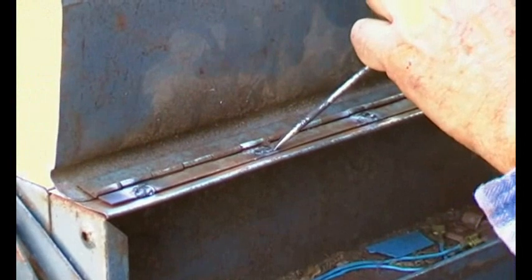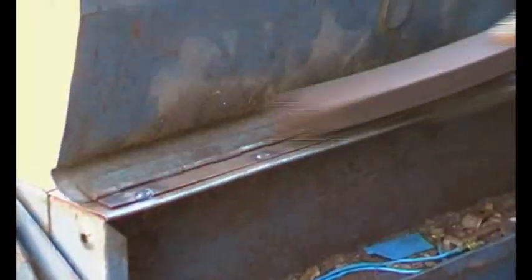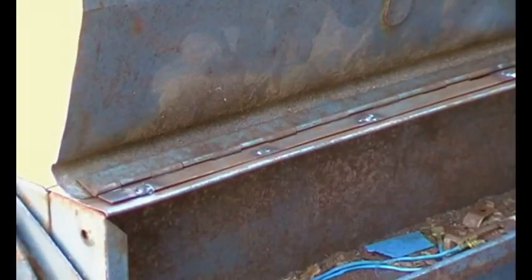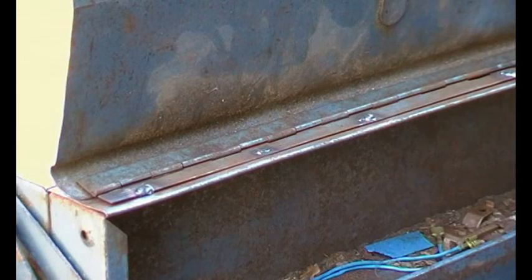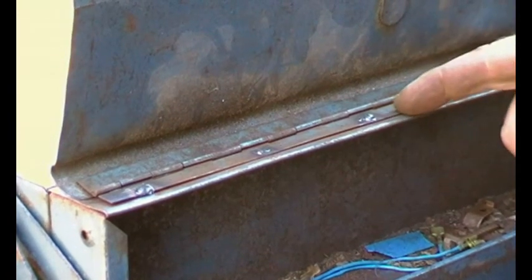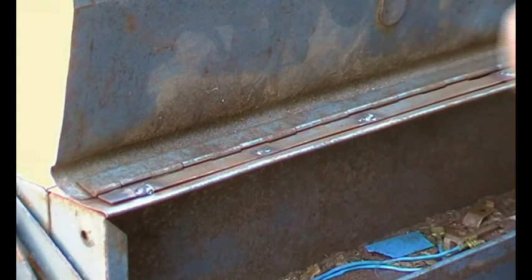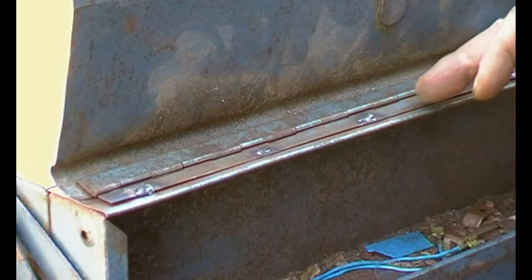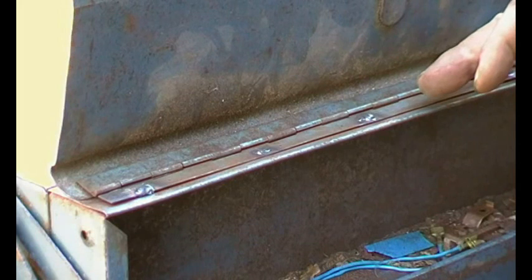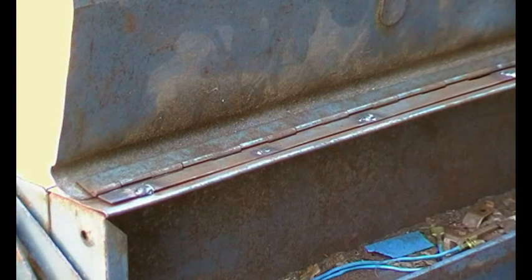That's raised up a little bit, but that's quite a nice looking one. I think that will do. It's obviously better than those little spot welds. It just proves that you can plug weld on fairly thin steel with an inverter welder. We were actually set on about 70 amps and using a 2.5 rod. I didn't want to use a thinner rod because the heat might have been more intense. Anyway, give it a go and it's worked. Cheers for now.